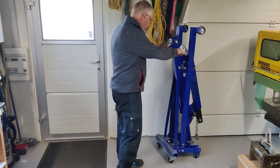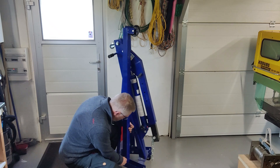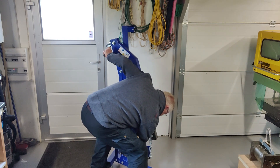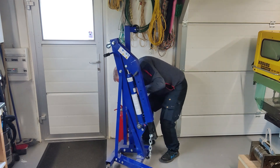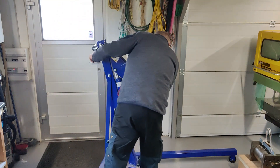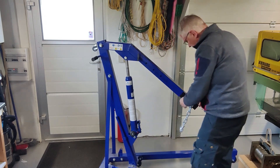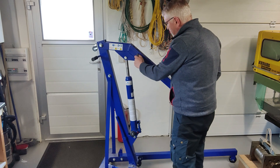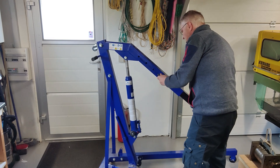As the first step I need to unfold my motor crane — engine crane here. It has some long legs that go down here and are secured by these bolts or plugs, same for the other side. So now I should be able to lift the mold up. Usually you can raise it a little here first. It has a thousand kilo capacity here — 750, 500, 250 — and the mold is around 50 kilos or so, so we can use the long reach.